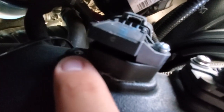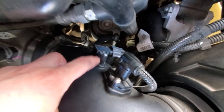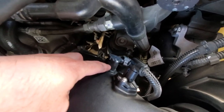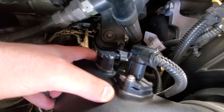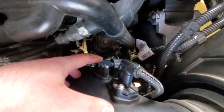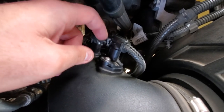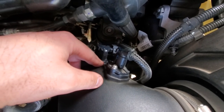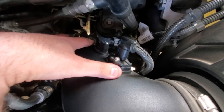Maybe they tried to use this tube for something else. Back here you can see there's a nut — it's usable. The material is foamy, so with one side going all the way down, the other side still has a little movement. It rattles its way out, the bolt comes out, and you lose your sensor and it goes dangling. Lucky me, I kept my spacer but lost the material on the bolt. The solution I'd say is to build another ear here, put a screw in there to secure the spacer firmly on both sides. I put some locking washers in there as my fix. Someone add another ear to this bracket and use the nuts already sunk in — it'd be an easy fix.